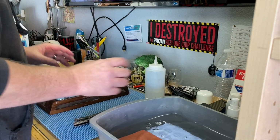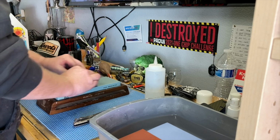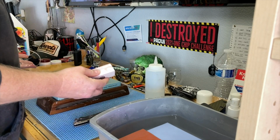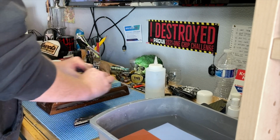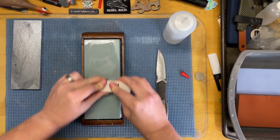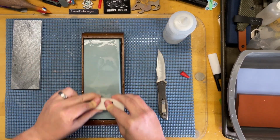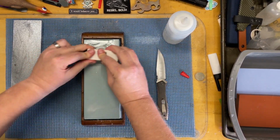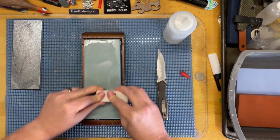So the next thing, we're using water stones, good water stones. You want to build a slurry. Unlike diamond stones, remember I was talking about the stones loading? Water stones don't do that. Water stones build a slurry on their surface and it just continues to cut and it actually cuts better the more slurry you have. So if you could see, there's a little bit of a white residue forming in that liquid, and that's going to be the slurry we want